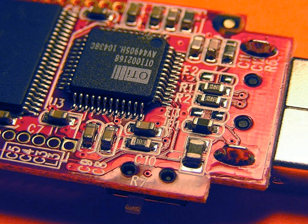Handling of small SMT components can be difficult, requiring tweezers, unlike nearly all through-hole components. Whereas through-hole components will stay in place under gravitational force once inserted and can be mechanically secured prior to soldering by bending out two leads on the solder side of the board, SMDs are easily moved out of place by a touch of a soldering iron.